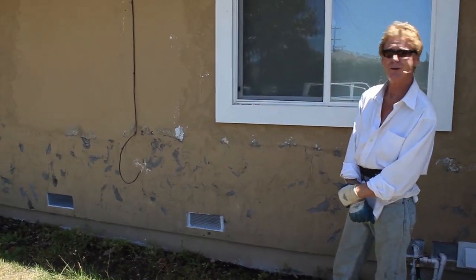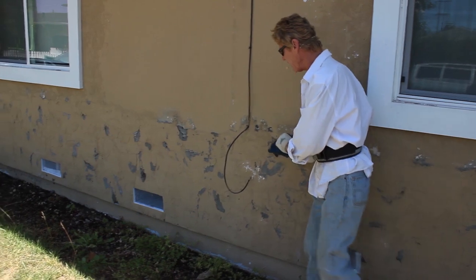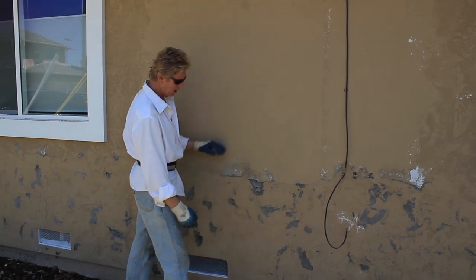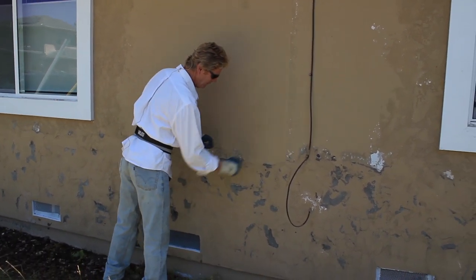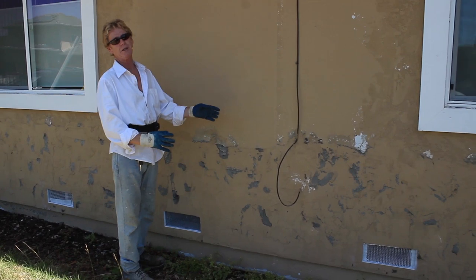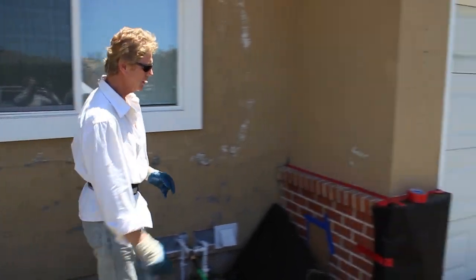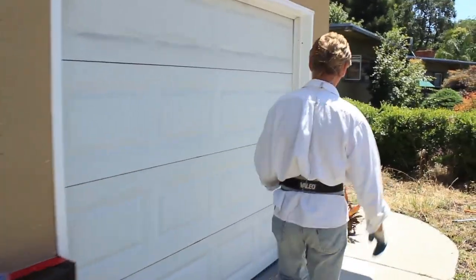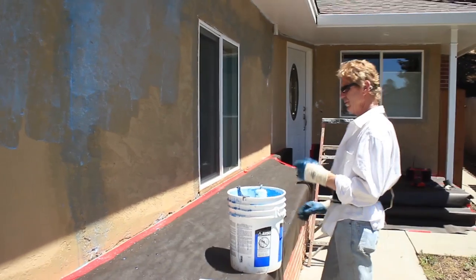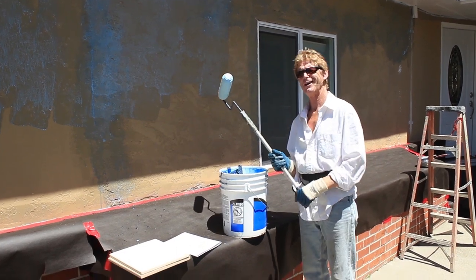What Jay did is take the rotary hammer and chip off a lot of the high spots. We're about to get to this wall — we'll glue it and I'll take some color coat, same thing we're applying tomorrow, and fill in some of these voids. When you look at something and say you're going to do one thing, it's okay to improvise once you get there. Anyway, we're going to continue applying the bonding agent. If you hire somebody they've got to know what they're doing — use this as a reference.